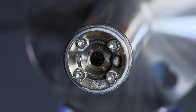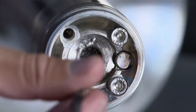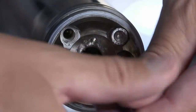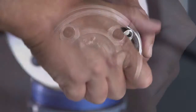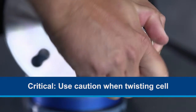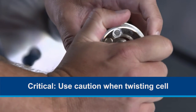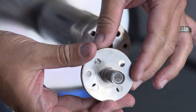Next, remove the four fasteners holding the O2 cell to the probe flange. Please note that the cell is resting on top of a wire mesh pad that is connected to a wire running the length of the probe. Over time, the cell can bond to the wire mesh pad, and it becomes challenging to separate the pad from the cell cleanly. So, here, you will want to carefully twist the O2 cell before you pull it out, to effectively break any bond between the mesh pad and the O2 cell.